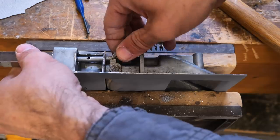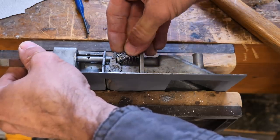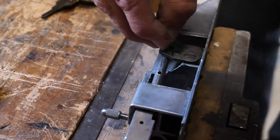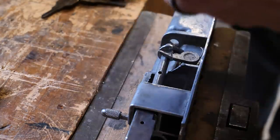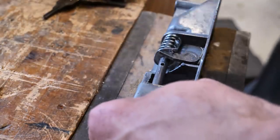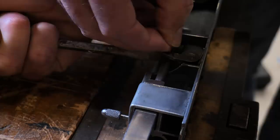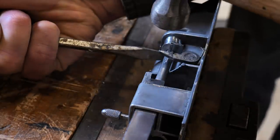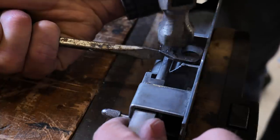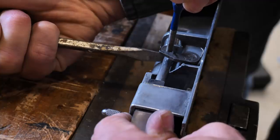With the handle finally on, I wanted to show you this part. That is the original washer or catch that goes behind the spring. This is the new spring, which is actually bigger than the original, so that washer just slipped inside the spring and under the lever arm — it's not catching. So what I had to do is make my own washer — a teardrop-shape washer that fits a little bit tighter around that rod and worked a lot better. I had my dad here to help because it's really difficult with two hands. You've got to hold the spring back and then put the pin in, which holds that washer from sliding forward under the pressure of the spring. Be careful not to go too far with the pin — it needs to be just under that arm that's going to throw the rod. If you go too far, it actually hits on the casing down below.